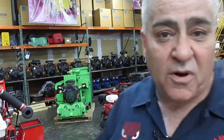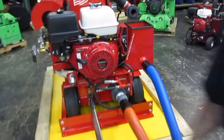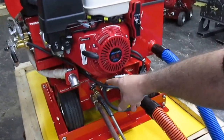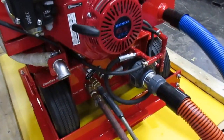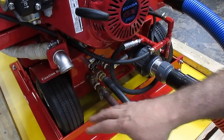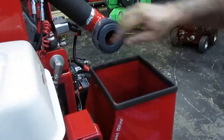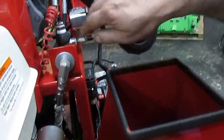So the first step, if you remember, was I lowered the RPM. I allowed the machine to calm down because I don't need it to make any more hot water. Second step was to open the bypass to the front. And if you notice, as I opened that, the machine started discharging a lot of heat out. That means the heat system is coming down and cooling off. My third step was to remove the filter and block the airflow to get the blower dried out.